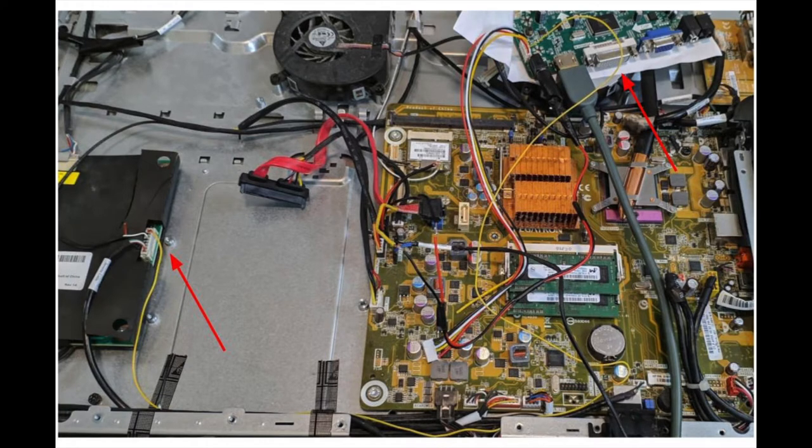Hi, this is editing Toby. I realized I did a very poor job explaining something. I said I was going to fix this in the morning, and then I fixed it in the morning and didn't show it on video. So basically, this yellow wire you can see on screen is going from the enable pin on the backlight driver included with the HP, to the enable pin meant for the backlight driver of the LVDS connector. What was happening was the LVDS driver was switching off but the display's backlight was staying on, so the display was going solid white. This allows the LVDS driver to switch off the display's backlight. That red wire that's cut is the wire from the computer. They both used 5-volt logic so this was perfectly fine to do, and I found it by probing around a little bit.